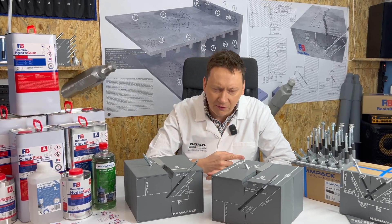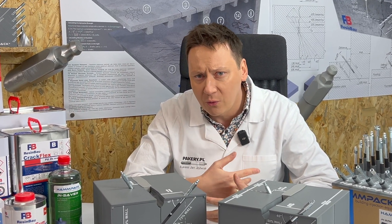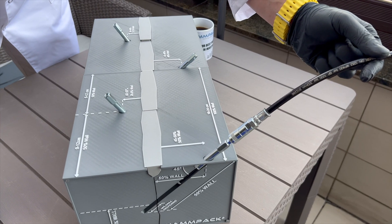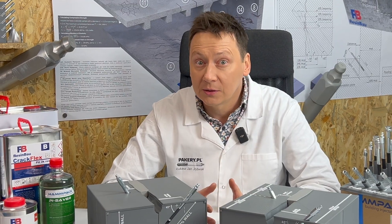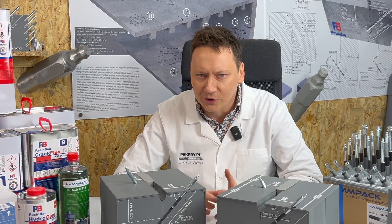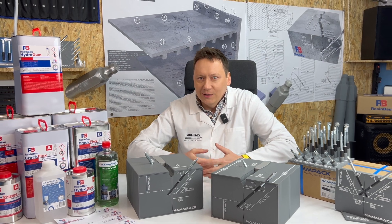Note the Humpack M6 valve opens at 4 to 6 bar, so we aim for about 6 bar when the resin starts to flow. When the resin flows, keep pumping without adding pressure. If the flow stops, slowly increase pressure: 20 bar, 30, 40, up to 60 bar and more.